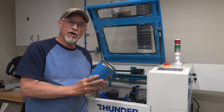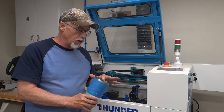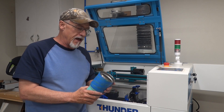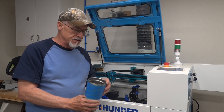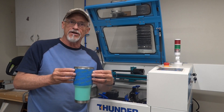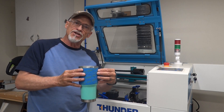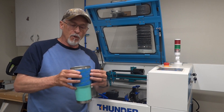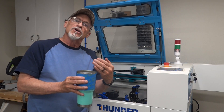Steps per rotation are pretty critical in that respect. This is a 30-ounce tumbler — 4 inches in diameter, about 12 and a quarter inches in circumference — and if you don't do this when you do your layout in Lightburn and you wanted a logo on opposing sides or 180 degrees from each other, if you don't have your steps per rotation set up correctly on your rotary, they will be off, meaning they won't be directly across from each other.